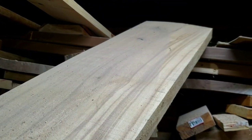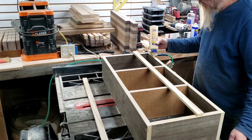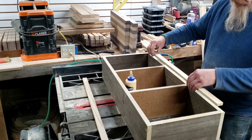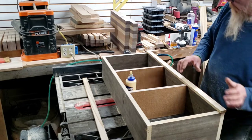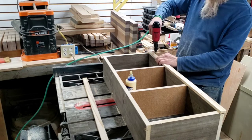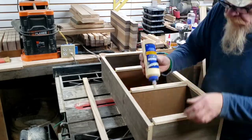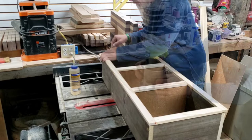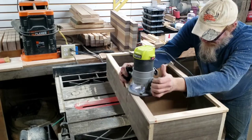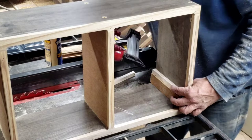Being a piece of shop furniture, it doesn't hurt to dress it up a bit. I'm using a little hardwood trim — nothing says classy like spalted maple. I have five-quarter spalted maple for the trim. I'm putting it on so it overlaps just a bit, and that's purposeful — it's for ease of assembly and takes the guesswork out of the inner trim pieces. They just all have to be the same length and I can get them all installed quickly, then come back with a flush trim bit all the way around on the inside of the cubbies and the outside of the box. Everything is flush and it creates a nice little rounded detail on the inside cubbies.